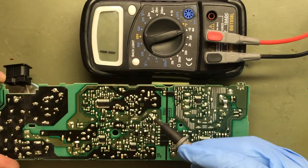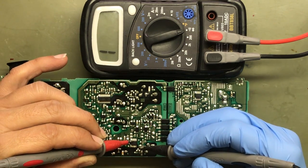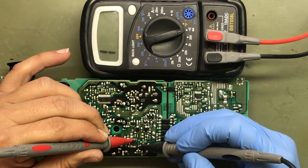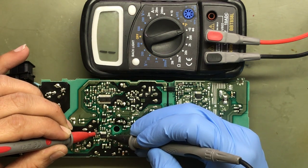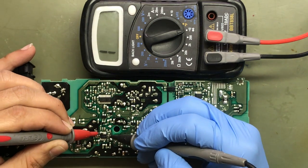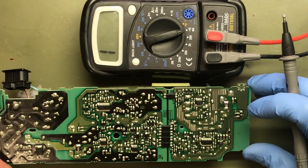I don't have the 1AOs that are bad. Check these here real quick — those PMICs. I'm just checking for shorts, not continuity, not any diode readings, just shorts. This is DAP041, I believe. No shorts there.